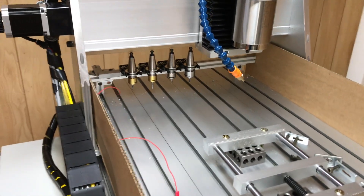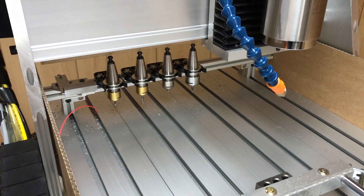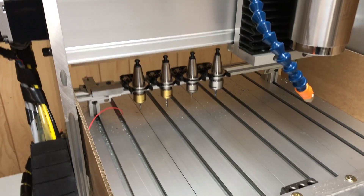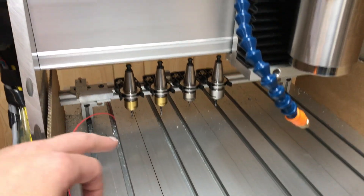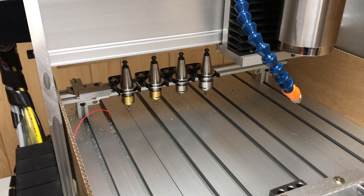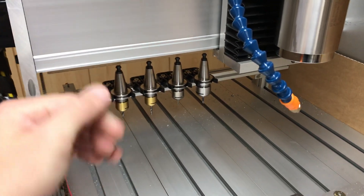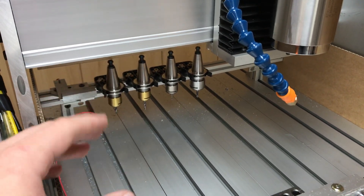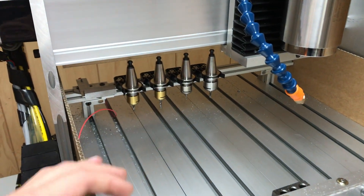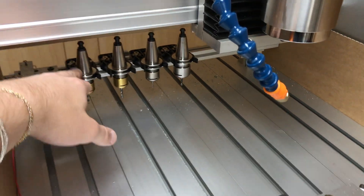The biggest issue right now is that the tools get dirty with chips. I've had to really up the PSI but it still doesn't reliably get all the chips off. I'm still waiting on my linear rails and piston cylinder assembly to come in — I'll be making my own pneumatically actuated tool holder. When the spindle comes back to get a new tool, it'll pneumatically move forward with about a 100 millimeter stroke, clamp over the previous tool, the spindle goes up, grabs a new tool, and then it retracts back.